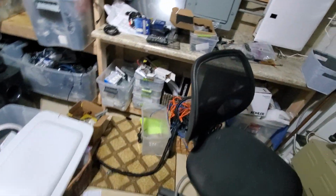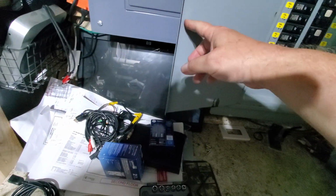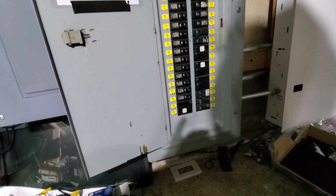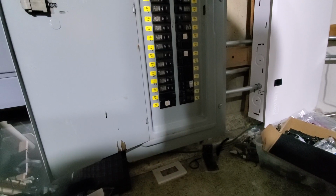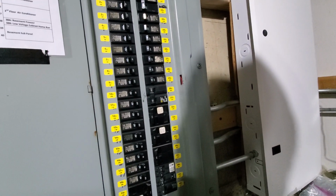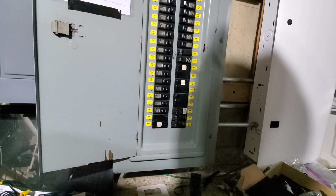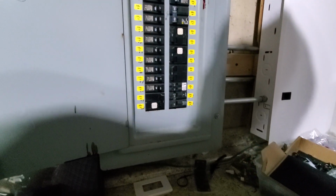So that's that piece. And then your circuit panel, let me just sneak in back here. Well, HVAC and well, it says. All right. So it's a GE panel, beautifully marked. So first floor furnace is on a 15 amp. First floor air conditioner is on a 40 amp.